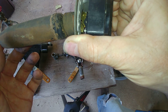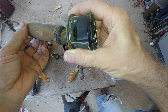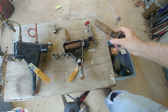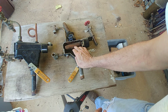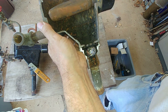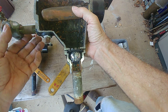If the water level drops, that turns off the upper contacts and turns on the lower contacts. If the float is up, the lower contacts are off — those are usually hooked up to a feeder — and the upper contacts are hooked up to the burner circuit. If the level is at or above, those contacts are closed and the burner fires. As the water level drops the float will drop. That switch is probably shot — probably why this thing was replaced, causing the boiler to dry fire. That's what's inside, and that's why you have to blow it down.